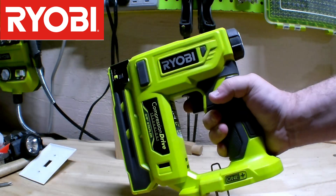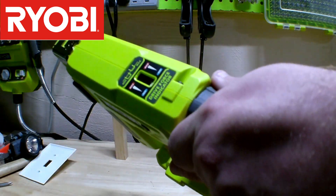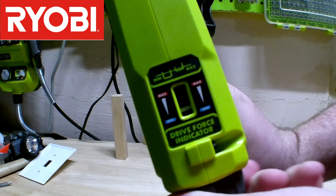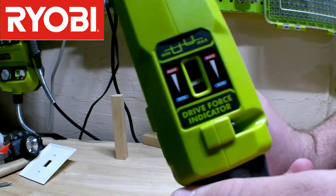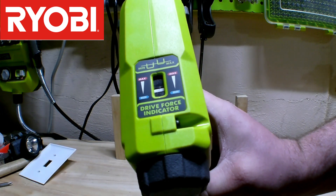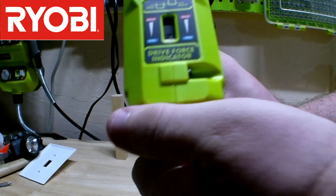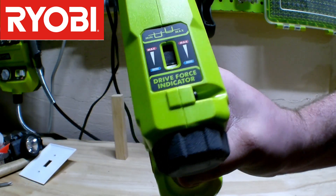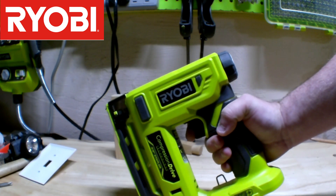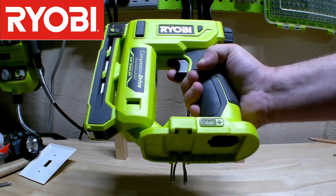But the tool itself is what I'm interested in. It's as simple as just — it's a staple gun, but you got some pretty cool features. Right here, if you adjust this knob, you can see a white line. The more you turn it, the higher up that white line goes, and that's because that's the more power you're putting into the staple to really sink it. So if you want it to barely sink in just enough to hold a wire up without pinching it, you turn this knob all the way back and it'll go into the wood just enough to hold it. That's a really cool feature. Pretty cool — not too heavy.